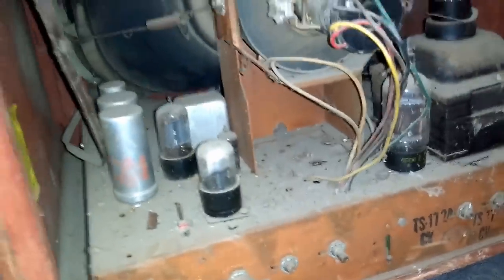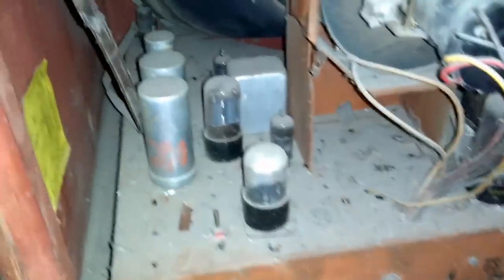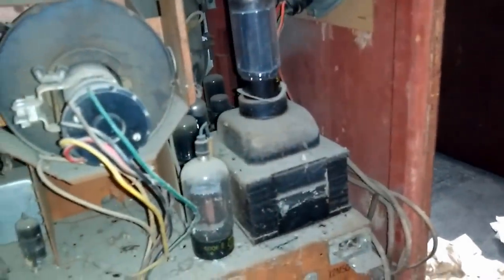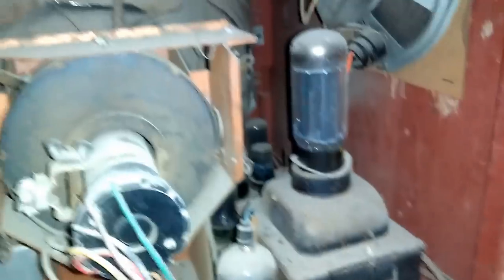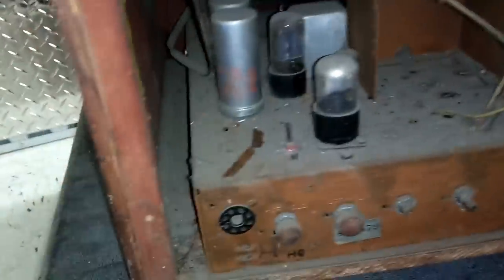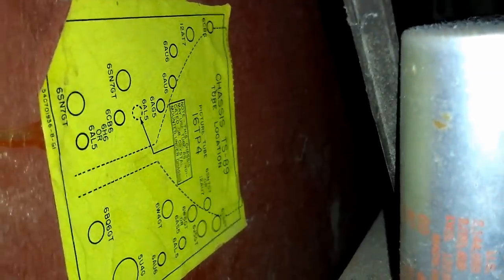Now the Motorola — one of the reasons this interests me is that Motorola generally made some lower end sets, by which I mean they usually were series-string with minimal tube counts, like all the 7-inch Motorolas I've shown in the past. But this is a little bit higher end — it has a beefy power transformer, a rectifier tube mounted on top, and it's in a wood cabinet with some kind of nice veneer on the front. Unfortunately it got a bit of damage here and there — this corner got dinged pretty good. But the sides are pretty generic mahogany veneer so that shouldn't be too hard to patch up. This is definitely a first-gen flat-sided picture tube — it says 16TP4 and the chassis is TS-89.